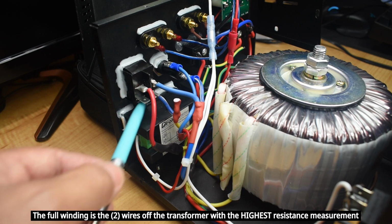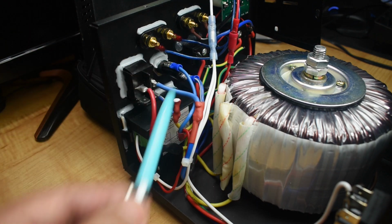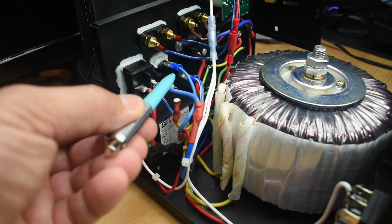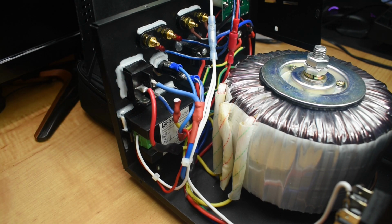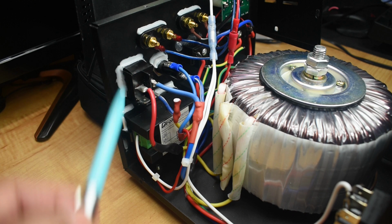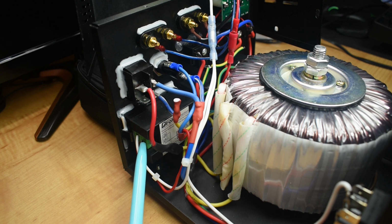Now before I made the cuts to install this gauge as well as the switch and drill the holes for these binding posts, and over here for the fuse holder, I took that round power indicating LED, which turned out to be a neon lamp, and got rid of it. There was no need to have it because when you turn the rocker switch on, it automatically illuminates. For the display module, you can see there's a green connector right here. The green connector is your AC input that you want to monitor the voltage, and the other side, in the exact same spot, is going to be a blue connector, and you're going to connect the blue connector to the two wires that lead to the current sensor.